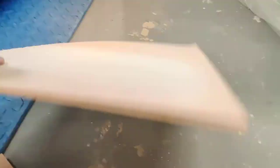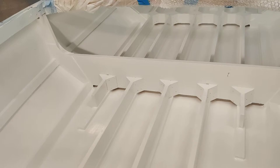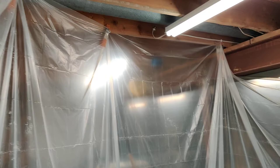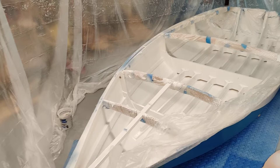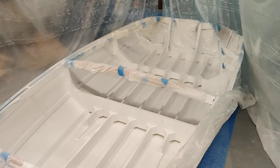I had a couple of boards on hand to test it out. One spray obviously didn't work too well, but I kept adjusting things until I got a really nice spray pattern. I set up a little impromptu spray booth with just one-mil sheeting, hung it up with regular spring clamps — really quick and easy — and that helped save the rest of my basement from getting too dirty. I masked off what I didn't want to spray, and it just works. I'm pretty happy with the results.